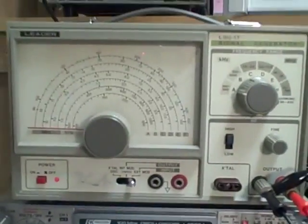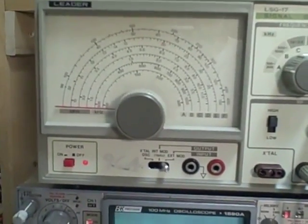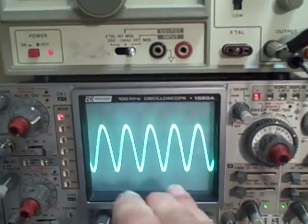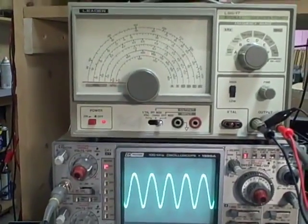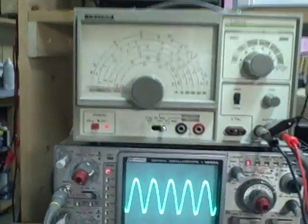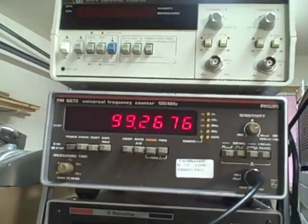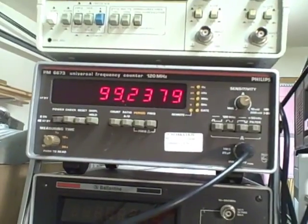What we're going to do now is run this thing through a quick test. We're going to take it through all of its ranges, sweep it through all the frequencies, and show you the output, which is right now being displayed on this oscilloscope. I'll back away so you'll be able to see both controls. Simultaneously, I am displaying the frequency, so I'll be coming up here to show you the frequency relative to the dial.